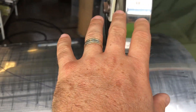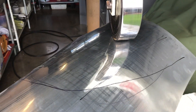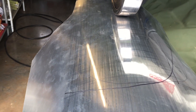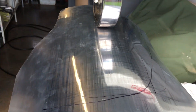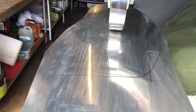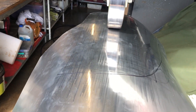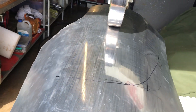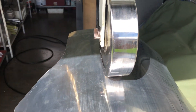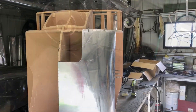Then we have to feather it all back out again as well. Sometimes you can do the diagonals — I've seen that a fair bit — but at the moment I don't want to do that, maybe later to get all the little ripples out. Basically back and forth, back and forth, keep them all close together. If you just run it through lightly it changes the metal differently compared to putting a bit of load on it — more load raises it more quickly but also leaves lines in it. It's a bit of a catch-22 depending on what you want to do.